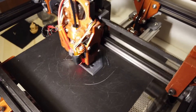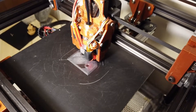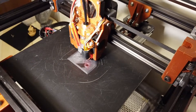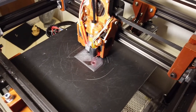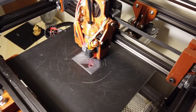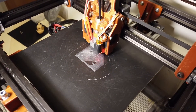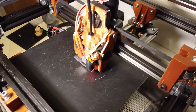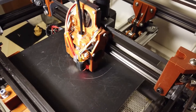I'm trying to run the fan at 35%. The fans are totally different from printer to printer, so I'm trying to run this as low as possible for the best possible adhesion. This part does not have a lot of overhangs, so it could probably have been printed with 0% fan, but anyway I'm going to try with 35%.